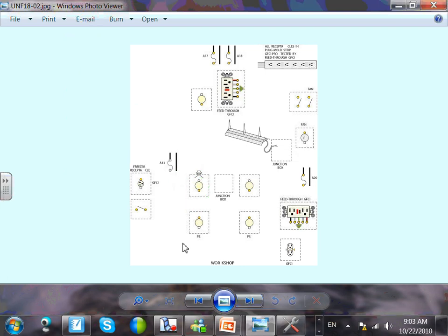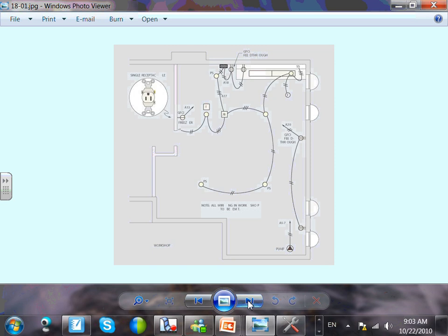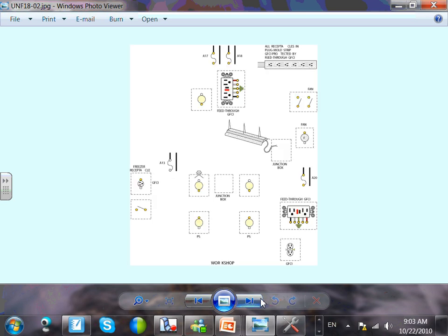DJ, I think you need extra credit, don't you? I think that they changed something to get the transformer. We should put them on the furnace. Oh, it's because the furnace had to be dedicated. Yeah, the furnace is a dedicated circuit. Yeah, you can't steal it from the furnace circuit. That's what they used to do.